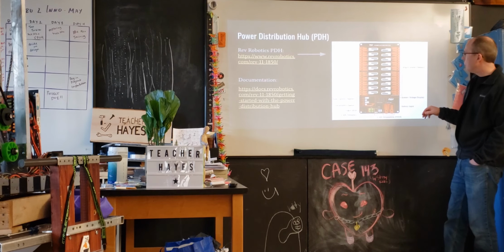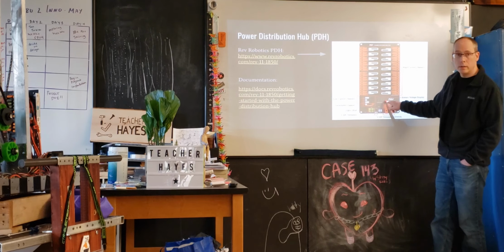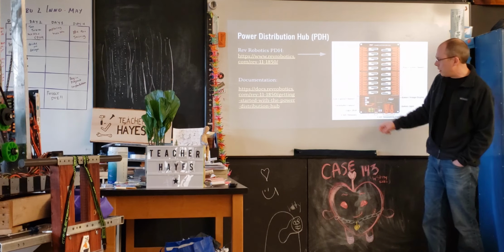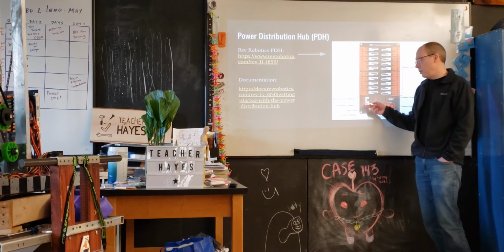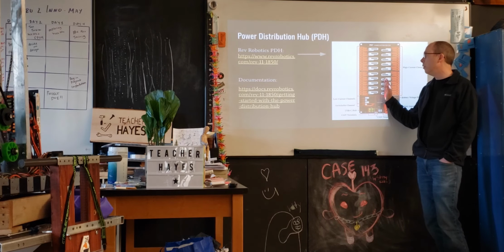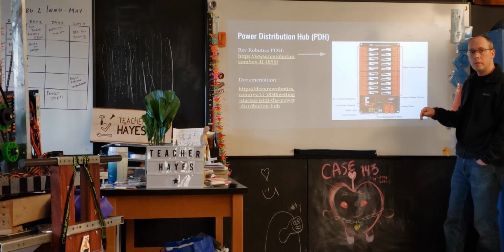This goes into a couple of the key characteristics, referring to these as high current channels, where you plug in fuses for each of these channels. Battery input, those are the large ones. You guys have seen the voltage here. You can always look at the voltage in bright letters there. The lower current channels, that's where you saw both the Robo Rio as well as sometimes the pneumatics. There's also what they call a switchable channel. You can turn it on and off at a certain speed. We typically have not used that, but you could use it for lights or things like that. It doesn't tend to be high current. It's not that fast, but it is something that you can control through the PDU itself. This does have a USB-C, so you can plug in to look at it if you want to. And then it has CAN here as well. We'll talk about CAN in a second. Any questions on the power distribution?